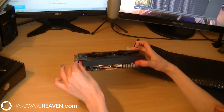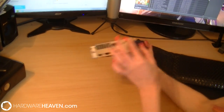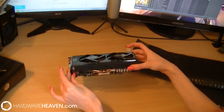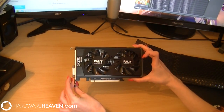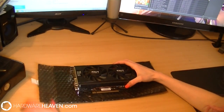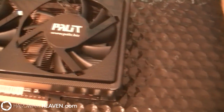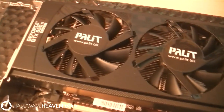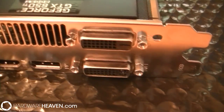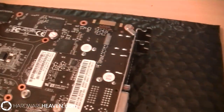On the inside we can see the copper piping. This graphics card has a 192-bit memory bus, up from 128-bit on the original 650 Ti. It has power of around 120W, peaking at 140W when overclocking. There is SLI support, which wasn't on the original 650. Memory runs at 1520MHz and is GDDR5. The GPU runs at 1006MHz, boosting up to 1073MHz as required.